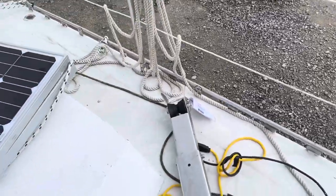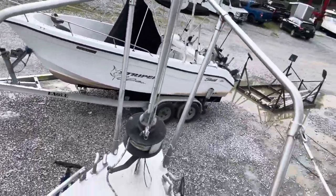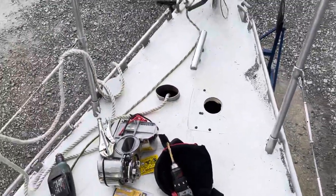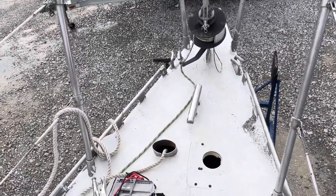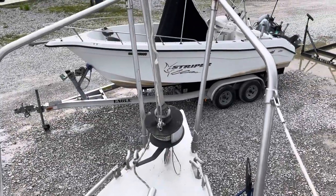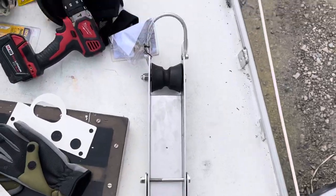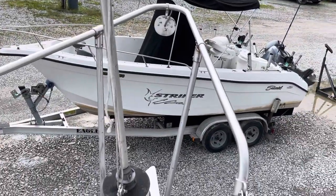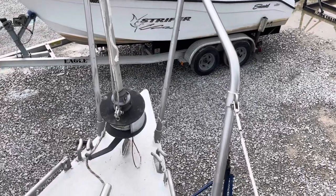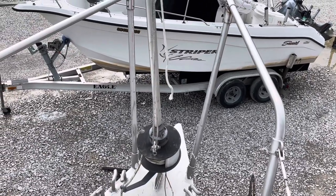What's really unique on this vessel is that with the bow being sharp and short, there's not a lot of room for a bow roller. Most people mount their windlass in the middle, yes, but not always on sailboats. I chose to put it off to the right, because on the right-hand side of my furler drum — that black thing — there's just enough room to slip it in under there and get bolted, or I think I'm going to tack-weld it down. That'll hold my 30 kg anchor over the side, which is a very big anchor.